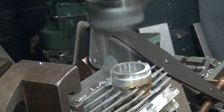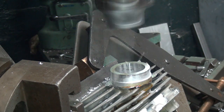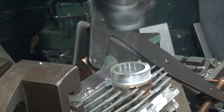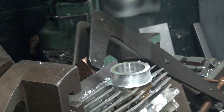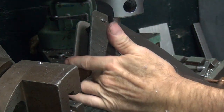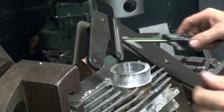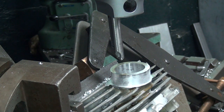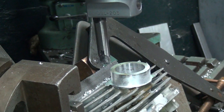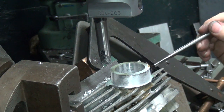Even on that side now. We'll clean up on the next pass all the way around. We're getting over 2.050 and we're at 2.250 right now — 200 thou more to go. We'll do another 100 thou — the last big one.